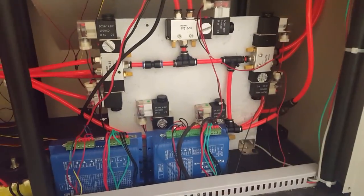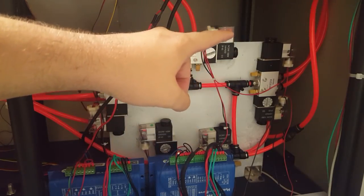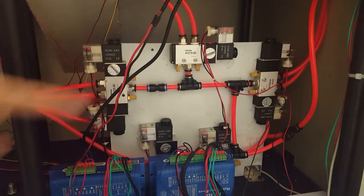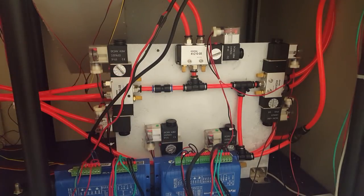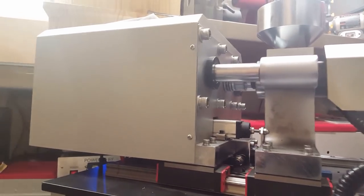And then the air side uses just a bunch of different solenoids in different configurations. Like this one's powered to open, or closing and opening is being powered. And then I think some of these, they just release the pressure to close or something like that. Not totally sure on some of these air systems, how they work. I know these are mufflers, so when the machine releases pressure, that's where some of the air will come out to release pressure from the cylinders. And then on the front, there's a control valve to control how much pressure goes to the main injection cylinder. There's actually two cylinders, and it controls the pressure for basically how much force it uses when it actually injects the plastic, so you can adjust that.